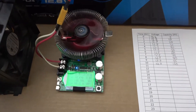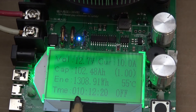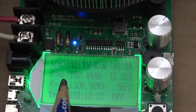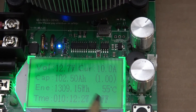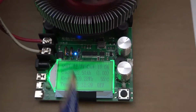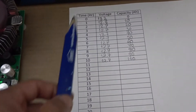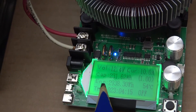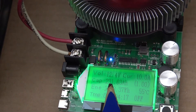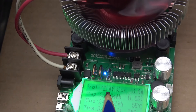It has been 10 hours. Let's see what we've got: 10 hours and 12 minutes, capacity 102 amp-hours, voltage 12.7 volts — still going strong. I have recorded everything here. At 23 hours, capacity is 231 amp-hours, and voltage has gone down to 12.4 volts.